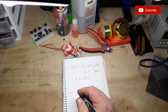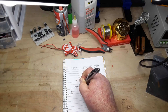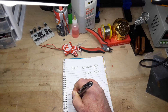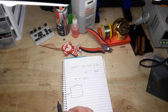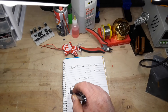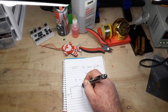We have our battery voltage — in this case nine volts — and we take that and put it through an inductor. Then we have a switch that turns the inductor on and off. When the switch is closed, current flows through the inductor in a clockwise direction and the inductor stores energy in the form of a magnetic field. But when that switch is open, that magnetic field is going to collapse.